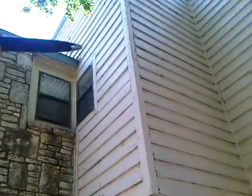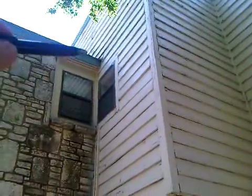So pretty good chance we're going to find some infiltration of water behind the exterior siding. Same thing here. This window, a lot of rot, a lot of water damage. This, probably that whole bottom 1x4 there is completely rotted out. I'm sure that's just paint holding that together. As we go up the wall here, really bad rot right in here as well.